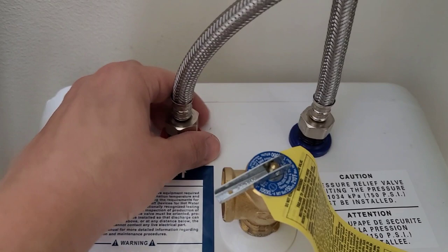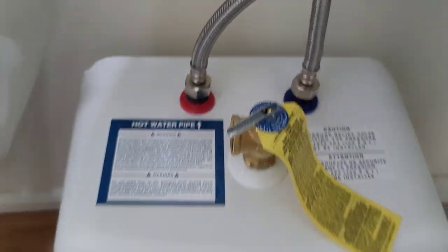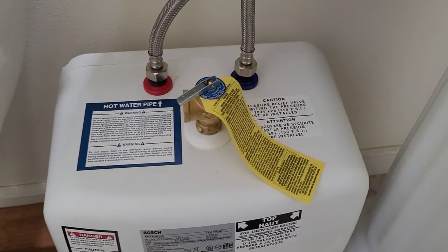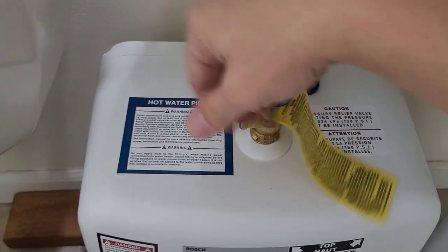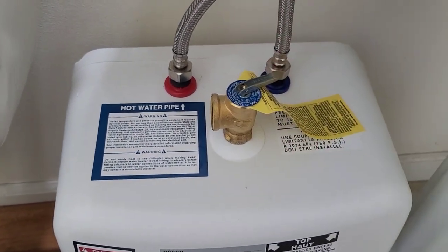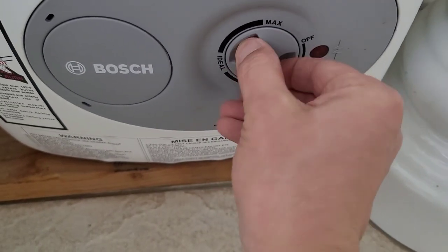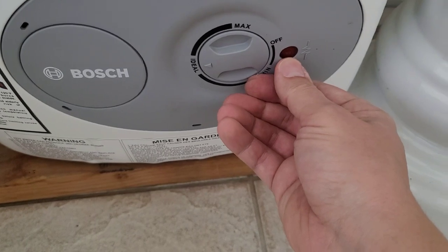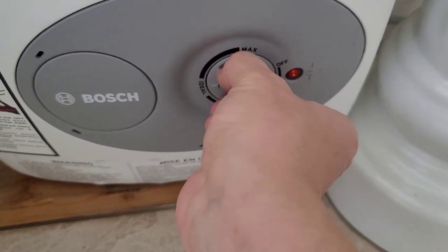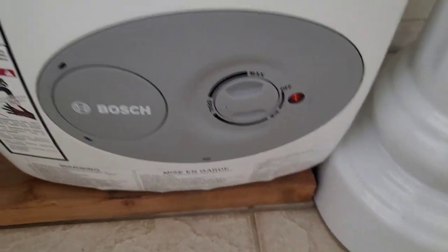What we want to look for is any leaking around here. We have hot water coming in already. We want to turn it off slowly and check for leaks. I don't feel anything here, nothing here. Now we're going to go and turn it on. This does have hot water in it from the line. I usually set this to ideal. The light's not on because it's already hot water inside, but if I really wanted to get it hot then the light would turn on. I usually set it to ideal because I really don't want it to scald. But that's it — now we have hot water on demand again.